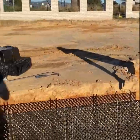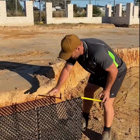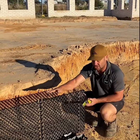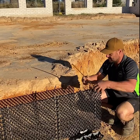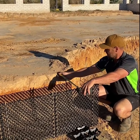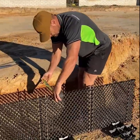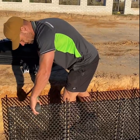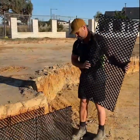Right, now we've pinned our wall nice and straight. We're going to come across the top. We allow that 30mm so the drain cell is going to actually sit on top of this drain cell and sit in the base — not on top of the base, it'll come straight into the base. So you want to measure from into the base to your face, which comes out around 540 to 550mm. We'll just cut it at 550mm — that's the average size, it'll make it work. Now we're going to go on top.